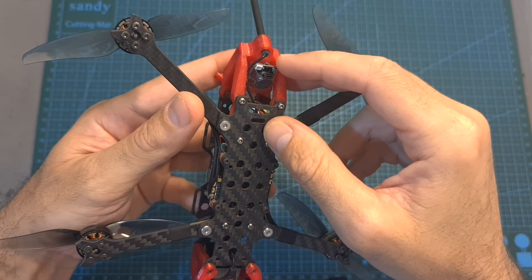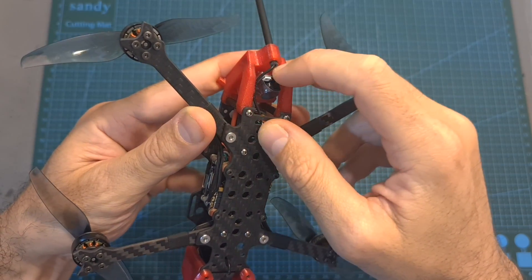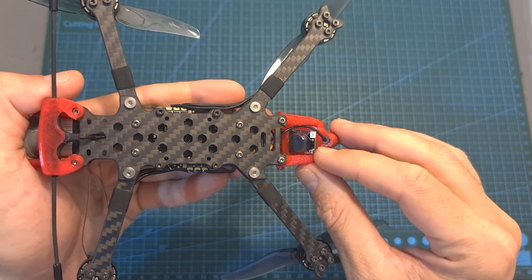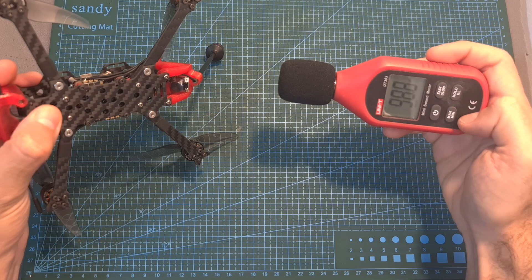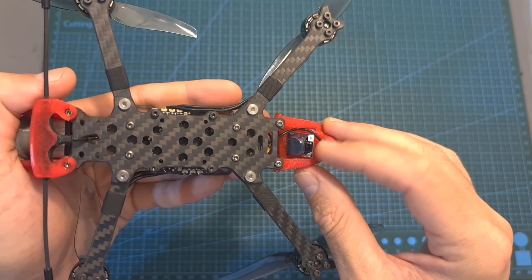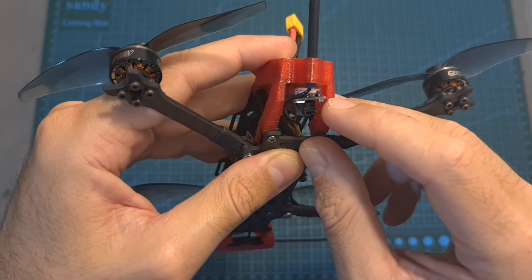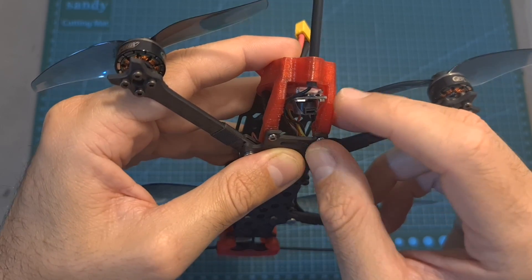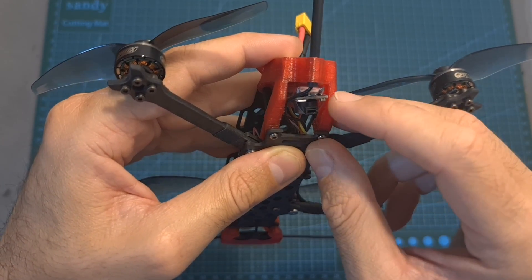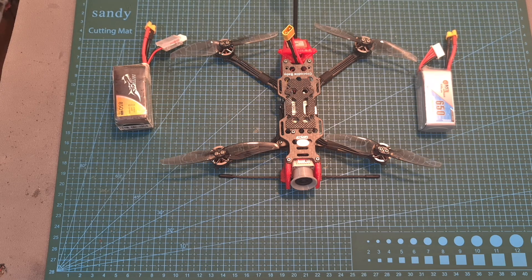As for the self-powered buzzer, each time you unplug a battery the buzzer is going to be armed, and in order to disarm it simply press the button. If you don't manually disarm the buzzer — for example in case of a crash — the buzzer is going to start beeping at close to 100 decibels, and the LED unit is going to start flashing, which will hopefully help you recover the quadcopter at night. When the drone battery is plugged, the buzzer acts like a normal buzzer which you can control using an auxiliary switch, and its internal battery should last for at least 5 or 6 hours.